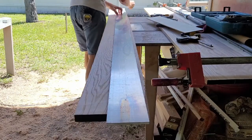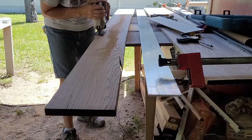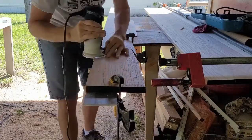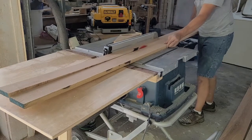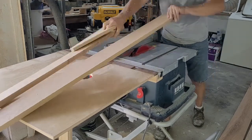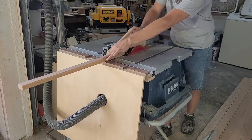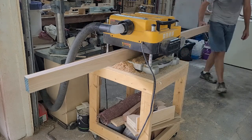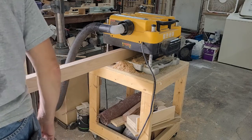While that was drying, I started to work on the top. All the edges of this stock were a little wonky. For a few pieces, I had to draw a straight line, cut close to that line with my jigsaw, and then use a straight edge to get a clean edge with my router and pattern bit. With a straight edge on each board, I ripped the stock to manageable pieces around 3 inches wide, marking the face of each board so I would know the grain pattern. Since I don't have a jointer yet, I cleaned up the edges by running them through the planer — a light pass or two and the saw marks were gone, leaving a clean edge for the glue-up.